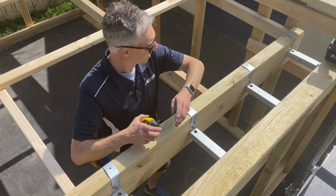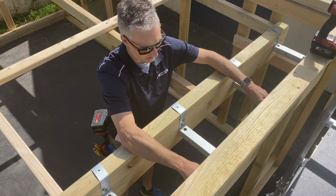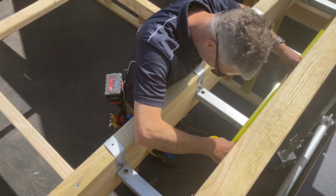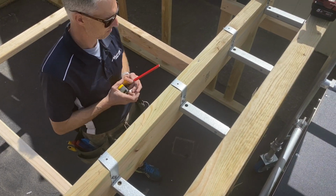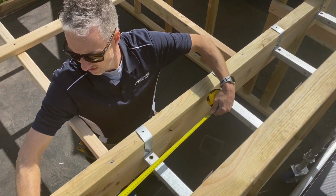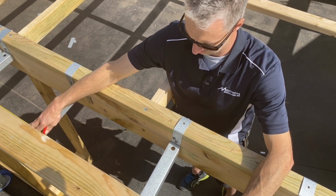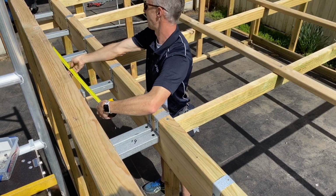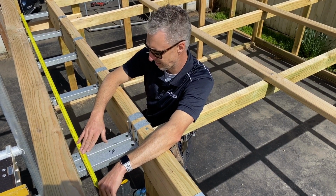With the sump section here, what I need to do is my corrugated iron will touch this wall because that's a high point. So I'm going to just go to the inside of this wall here and then to the inside edge of my sump here. So that's 1110. I'll just write that down so I don't forget. 1110 mil. Now with my high point section here, I'm going to go to the center of that and then to the edge of my sump again, which is 1.60 meters. And my last section here of the corrugated iron that I need will go right to the end there and then stop in the center of this high point here, which is 2315.